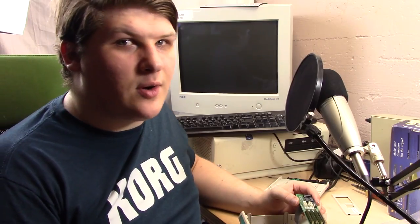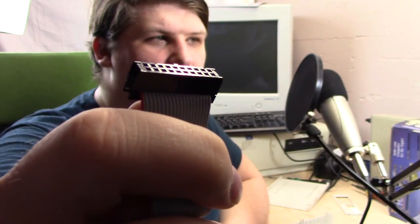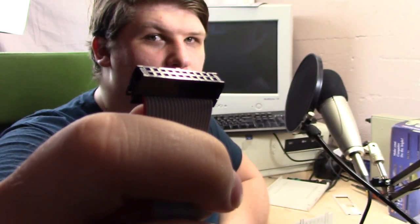If you look closely you'll see that the right edge of that ribbon connector has two extra pins just hanging off the edge of the connector. So why would you do that? Why not just use the right size ribbon cable? I've worked in electronics manufacturing and I can tell you that sometimes you just can't get what you need. So ribbon cable comes in standard sizes, and the only difference between them is how many rows there are on the connector. The connector has all these two-pin columns on it, so obviously every one of these is only available in even numbers.